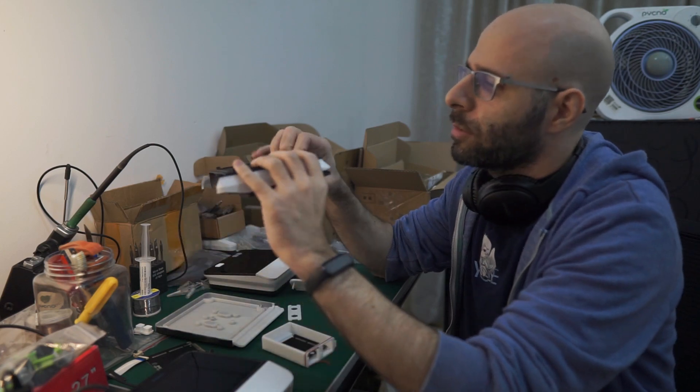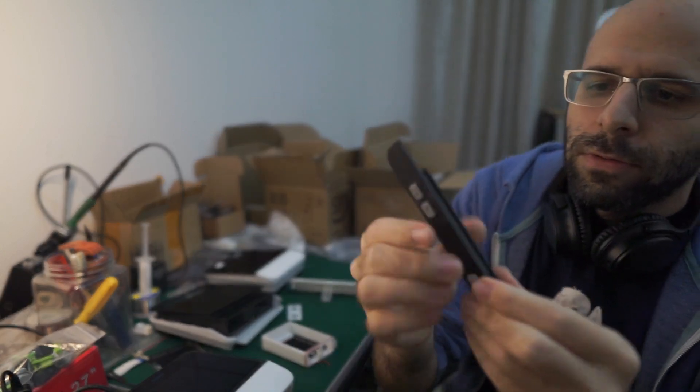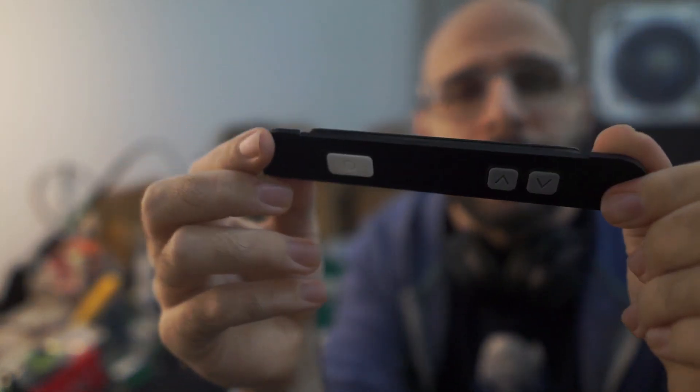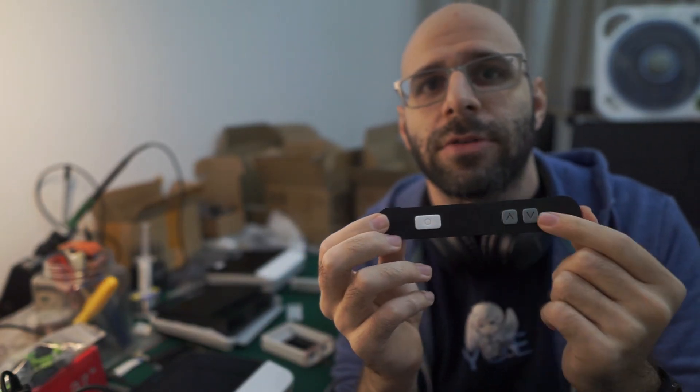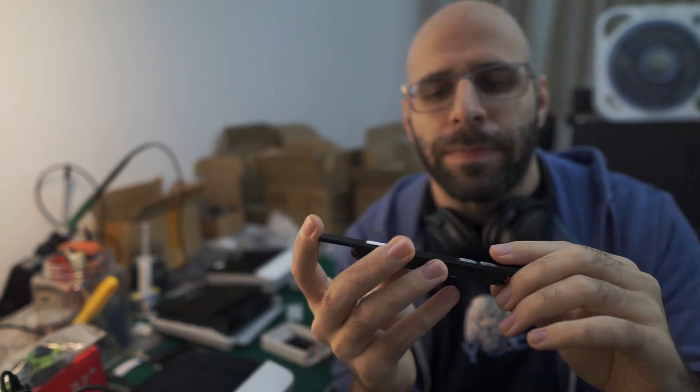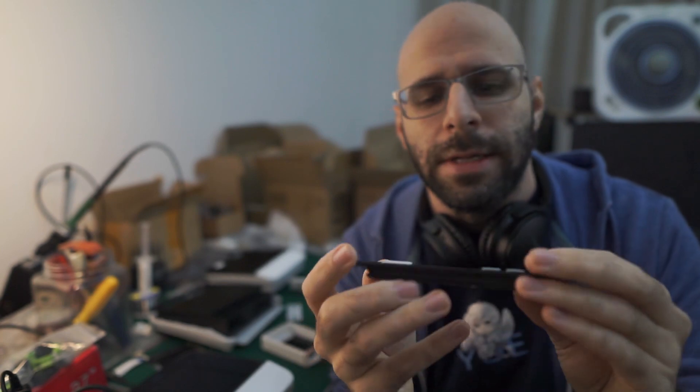We've been working on the buttons. One of the things we did is move to mechanical buttons. Originally the idea was to use touch buttons — when you touch them, LEDs or the OLED would light up. The problem is that during testing it's very hard to get reliable touch sensing from day one, and outside it's hard to prevent accidental presses, which could be catastrophic — pressing random buttons and executing random functions. We found chips that could cancel out false touches, but to be certain we opted for mechanical buttons.